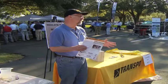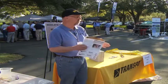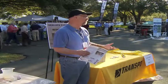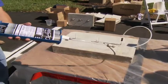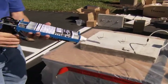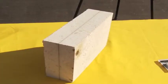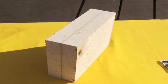What we've seen recently is a requirement to get cracks that are deeper and cracks that actually go vertical and then come off at a horizontal angle. So we've developed a very simple injection system with very low pressure — a couple of pounds of pressure. You can do it by hand or with a pump to make sure you get 100% crack filling. This is the slab that we have injected with low-pressure injection of high molecular weight methacrylate.